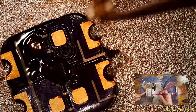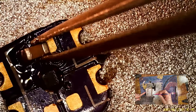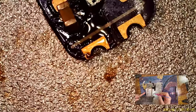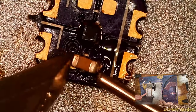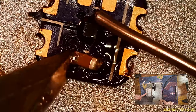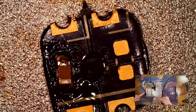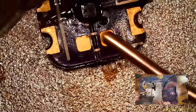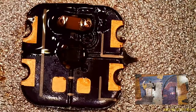Side tin, come in here, drop the part down, come on, flip it around. Sticky board, sticky tweezers, and come in here and you can do the other side, easy peasy. And I like to come back and do the first set again. Ta-da! Nope, that was entirely out of frame. My apologies, the frame is so tiny.